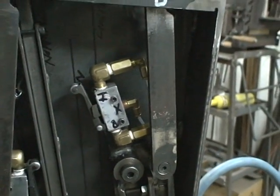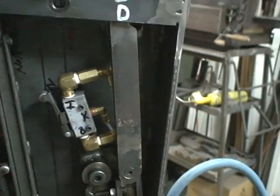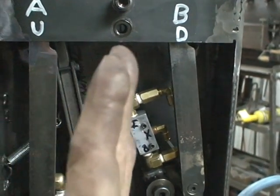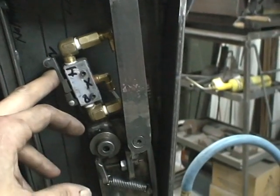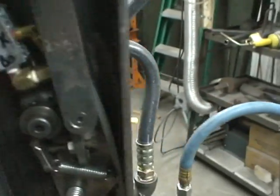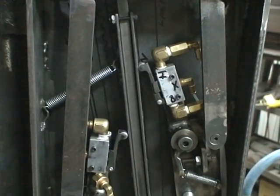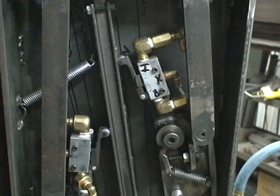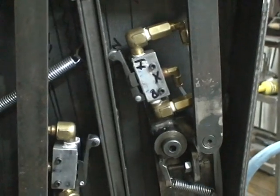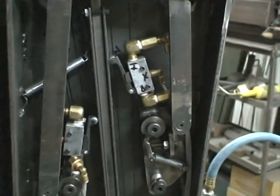This is the up air valve and this is the down air valve. As you push and change the angle, the up air valve opens, and as the head rises the steepness of the control arm changes and then begins to contact the downward arm. The more you step on the treadle the further the angle changes, so it's a pretty straightforward kind of system.